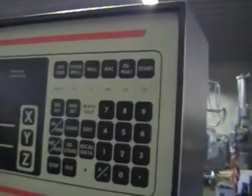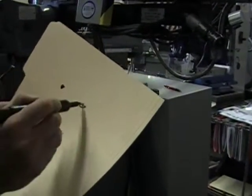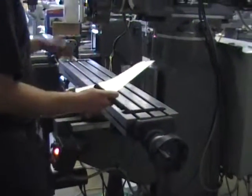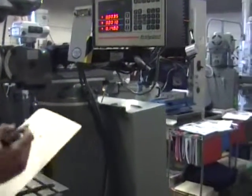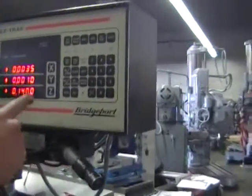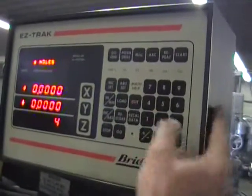So if I want to program a simple program — say, drill four holes in a piece of metal — I come over and turn the machine on. That's going to start the spindle. You can program in both without the spindle on, but I'll show you that it runs with the spindle on. I'm going to program basically this part right here: drilling four bolt hole circles. I'll do one drill cycle. It asks me a number of holes — I'm going to say four holes, then Enter.